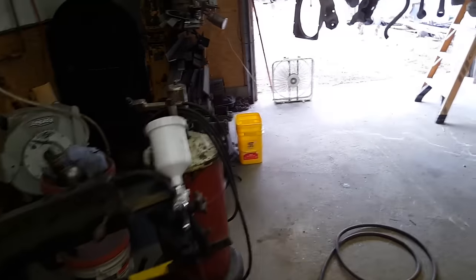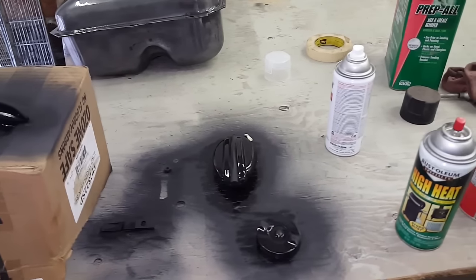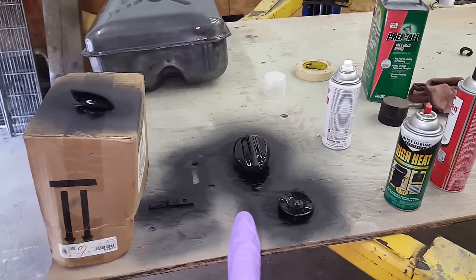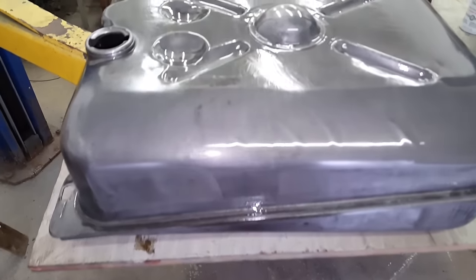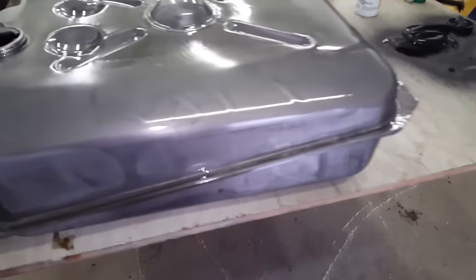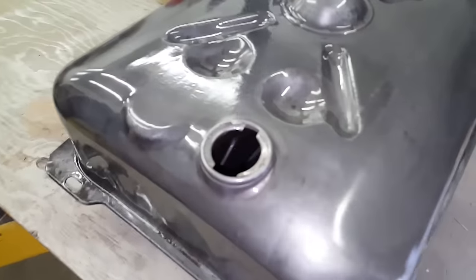I think all the gray stuff is painted. Let me show you real quick what I'm working on over here. The few black things that are going to be matte black — and I'm going to put clear over them — are the radiator cap, gas cap, and the little door to get into the gas cap. This is the original gas tank. I spent about five hours with Prepsol and 3M and got it back to near-stock condition, and I've just hit the top layer with some clear coat to prevent it from oxidizing again. It's very clean on the inside.